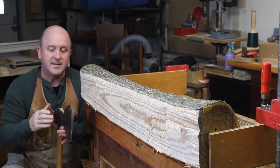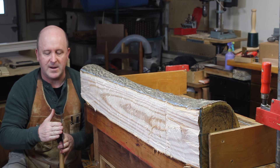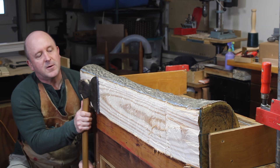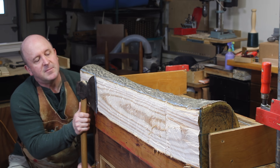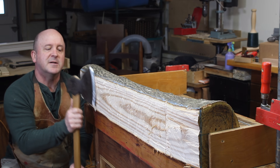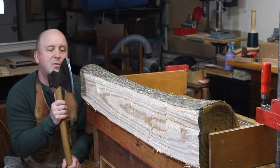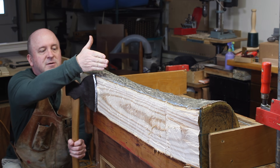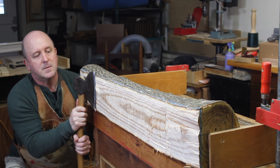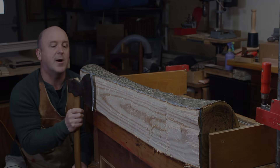There are some broad axes that are symmetrically beveled instead of flat — they'll have a wide bevel on both sides. The problem with those, even though they might seem more versatile, is that in order to cut, you need to be out at a much steeper angle, and you're moving in a direction even though you want your chip to go the other direction. So it takes more skill and practice to get a good job with a symmetrical broad axe.